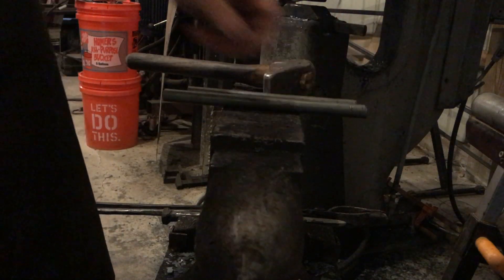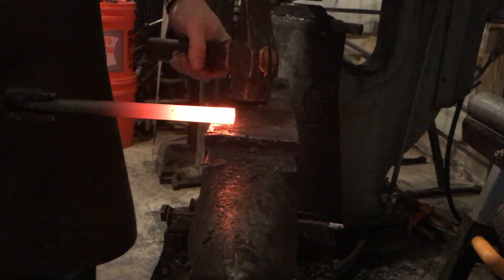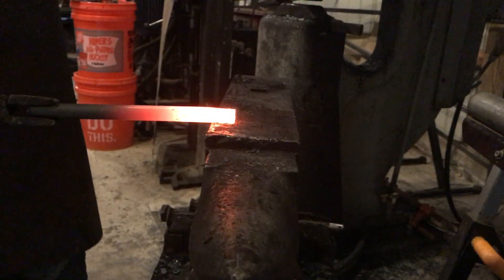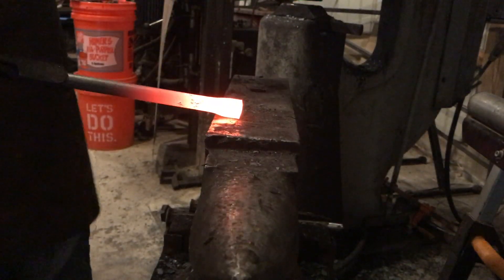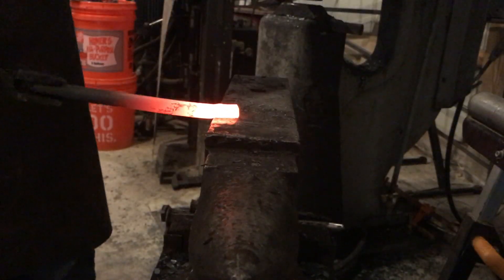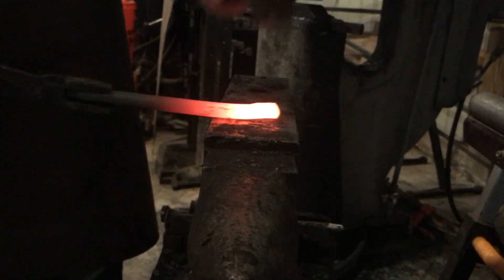The longer piece is what's going to form the box section. So we're going to start off like always — we're going to knock down the top of the jaw, the non-box portion. We're going to knock down one inch of it. Then we're going to start putting the angles on it, bevel it, and just clean it up as we go, make it look nice.